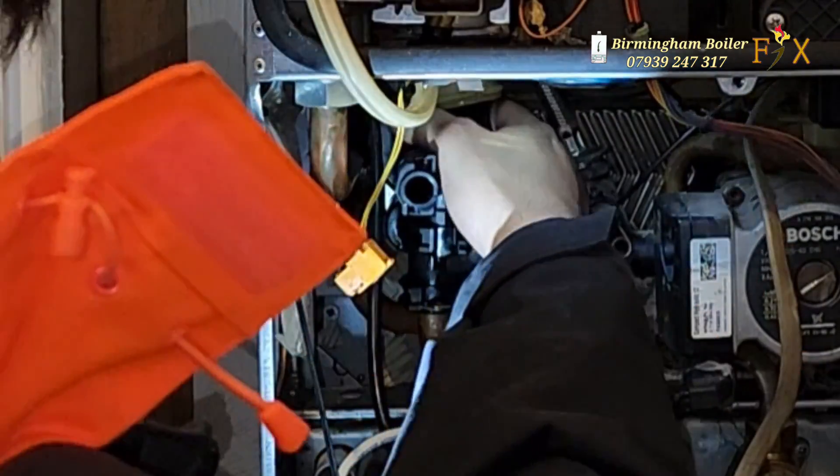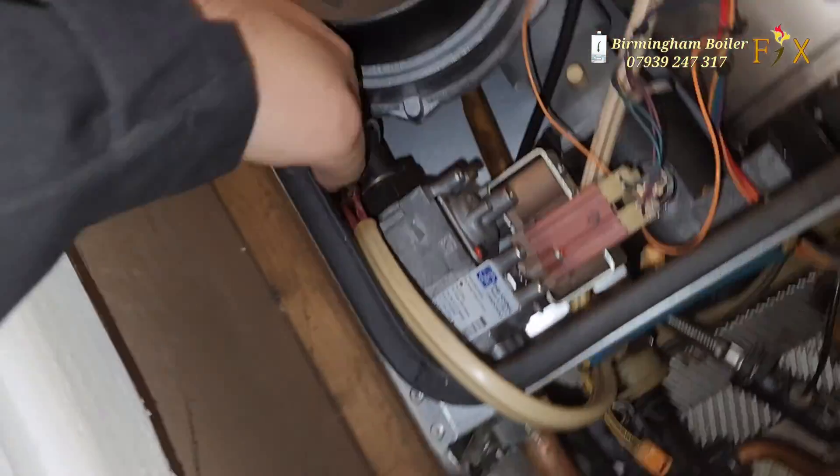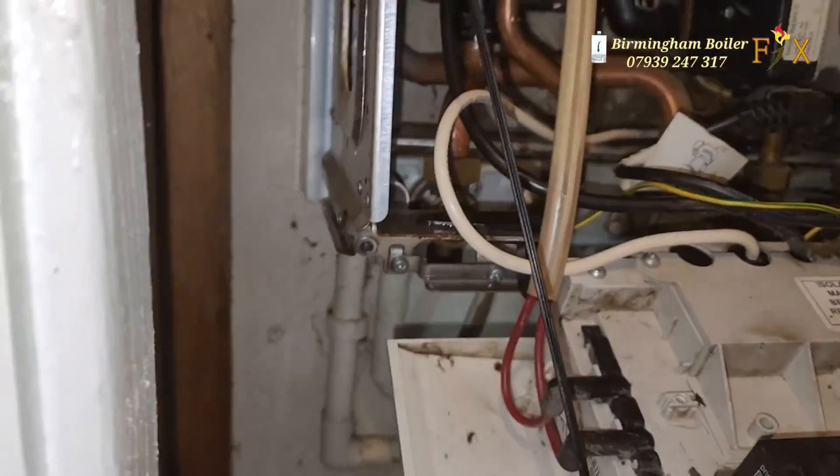This is just a short video on this flow manifold — I'm sure I've made many videos on it before. I've got all the pipes connected now. The most difficult pipes to connect are the bypass and the 22mm flow copper pipe. Once you've got those in, the rest is easy — just screw in, clip in, that's it.